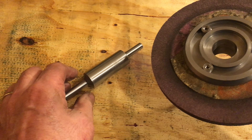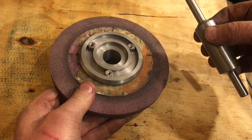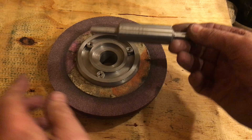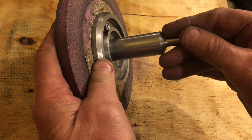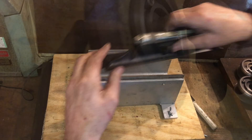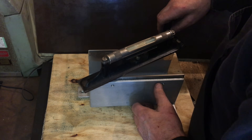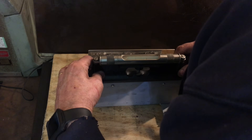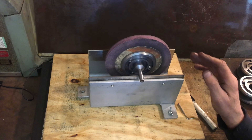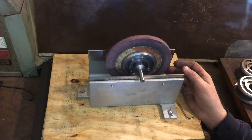The arbor spindle was made from the tool I made to set the wheel arbor spigot true to the bore. You can also see that at one end there's a small mark indicating it's the largest end. The wheel arbor slides up this spindle and is soon locked on about halfway along it. To balance the wheel requires a balancer — this one I use to balance my pedestal grinding wheels, and it works very well with them so I see no reason why it won't work on these wheels.